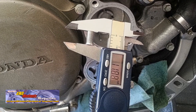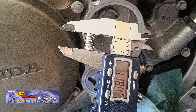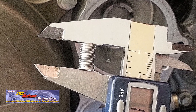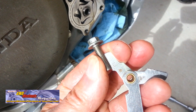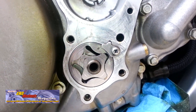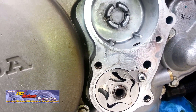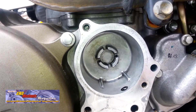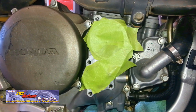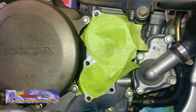This will allow the insert driver to pass through the threads securing the insert to the threads. The bolt thread pitch in this case is 1.0 millimeter on a 6 millimeter stud size. Note that the casting bosses around these blind holes are narrow margins, which makes this type of insert even more valuable.